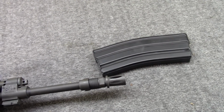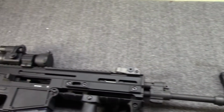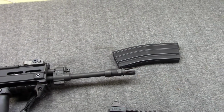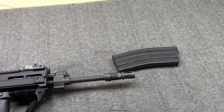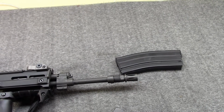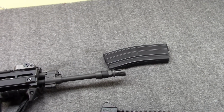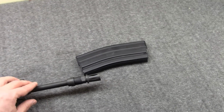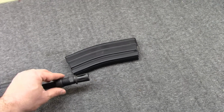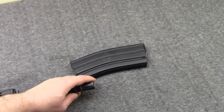For the civilian guns, when they did the Carbine in 2016, they changed the thread pattern to AR-15 standard 1/2x28. I know why they did it. I don't blame them. But as a military collector and purist, I really like the original threads. And that's what ultimately led me to change the barrel to the original 14x1 and then make an extension. I didn't want to SBR it for that, so I just made this work.